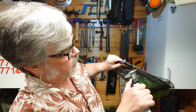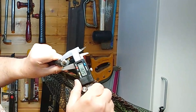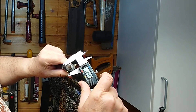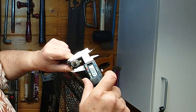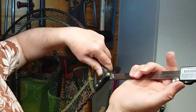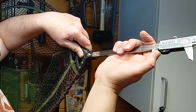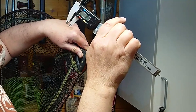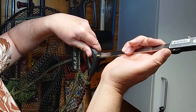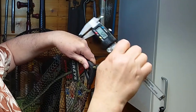This is, like I said before, an octagon. Across the flats it's 21 and a half millimetres. Across the corners, call it 22 and a half. And the depth between the edge and that washer is about five — five point one, call it five. Always check the other side: five point one, five point two.